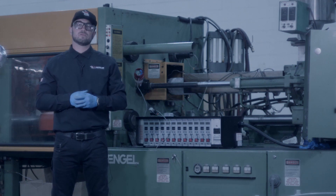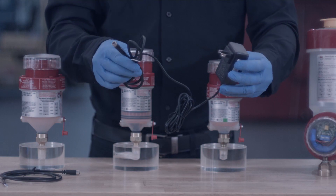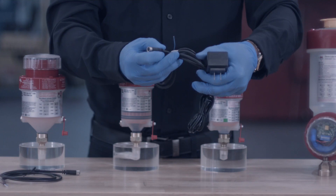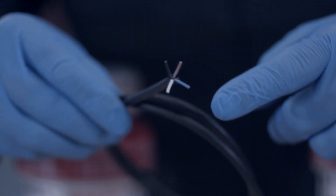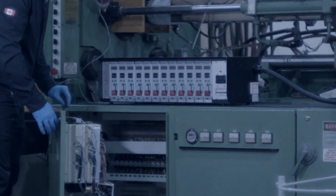This can also be run to a battery pack and or remote power unit. If you run to a remote power unit you will notice you have a blue and white wire. This is your dry contact and should be run to your PLC and or other device.